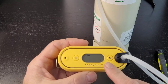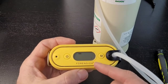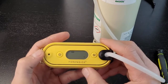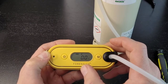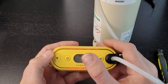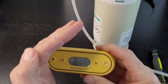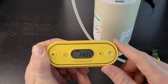It's been 60 seconds and I'm getting a reading of 0.0%. Zero air is coming in. Sometimes you may get 0.2 or 0.1. In this case, it's a well-calibrated oxygen detector — it hasn't lost its baseline or its calibration; it's at zero. So I don't really have to calibrate this; I'm just verifying it is zero. But if it was showing 0.1, you would just go ahead and press enter, and it will verify. The Z will start disappearing after a few seconds. You verify that yes, it is zero, and now it's back to the instantaneous display mode. It's alarming because you've passed that 19% alarm level — you can see the LED flashing. It's climbing back up because oxygen in the air is coming onto the sensor.